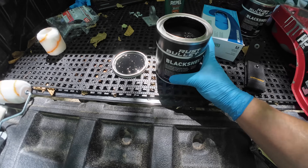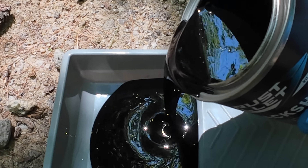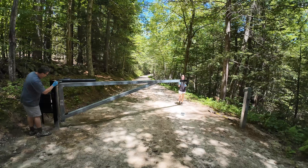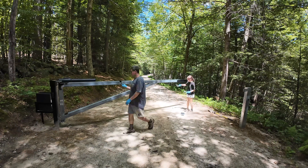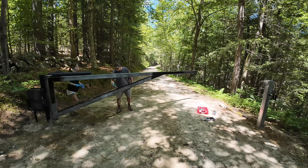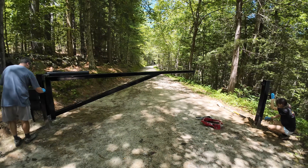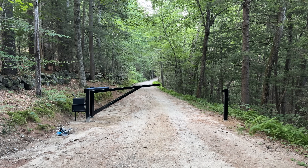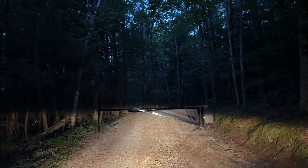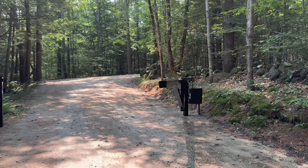I used Rust Bullet paint, which is specifically rated for steel including galvanized metal. You can paint galvanized with anything you want, but it's going to flake off in a couple of years because that coating keeping it from rusting breaks the bond with most paints — in fact most rust-only products say not for galvanized metal. I liked the way the black looked, but unfortunately at night this gate was completely invisible. If the gate was opening or closing and you were heading towards it, at some point the gate completely disappears and this thing would be like a spear going right into your car.